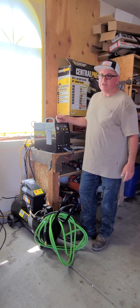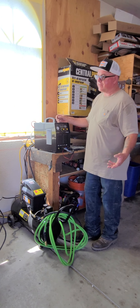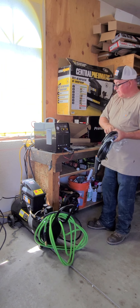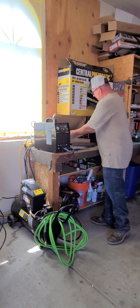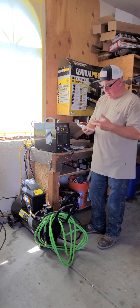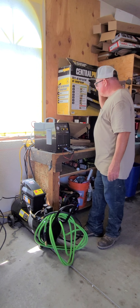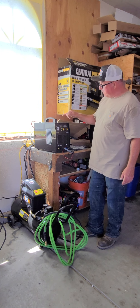The whole thing about this 45-pound machine is to be portable. One guy in New Zealand did it, and I did a conversion from metric. This setup works really well together — it's 125 PSI, 10-gallon tank, 2.5 horsepower motor, with 5.3 CFM at 90 PSI. You don't need more than 90 PSI to cut half-inch steel.